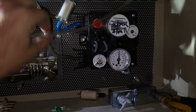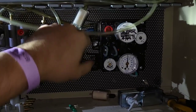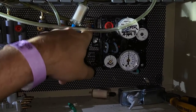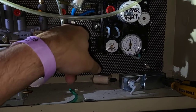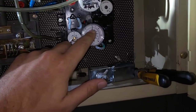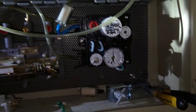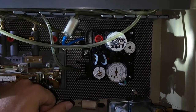We've got it installed now. Got to clean these tubes up. You've got your output, your main, and your CV — your controlled variable — which is your transmitter. Right now the transmitter signal is coming in pretty hot. We need to go plug everything back in and make sure it's all set up on that actuator, then go from there making sure it all tunes in and controls the way we want.